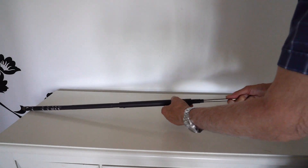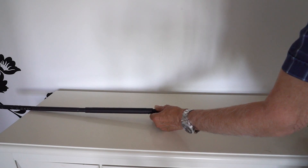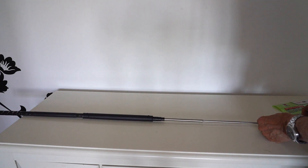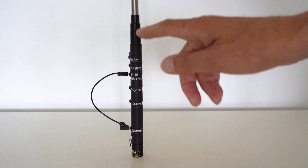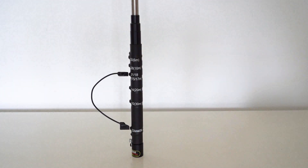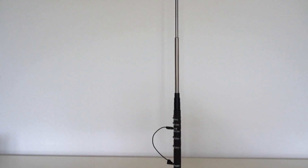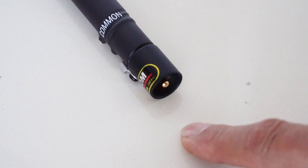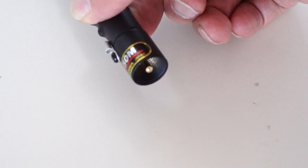So we have an antenna that covers 10 bands, 160 through to 6 metres. There's no mention of 5 MHz so I think it probably doesn't cover that band. The basic concept is a base-loaded whip from 10 through to 40 metres with additional add-on coils for 80 and 160. The whip on top is 1 metre long so the antenna complete is about 1.2 metres without the add-on coils. The connection at the base is a PL259, which means it'll fit a lot of different connectors.